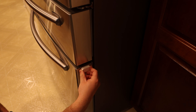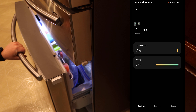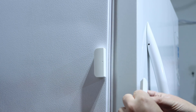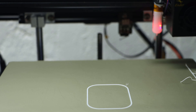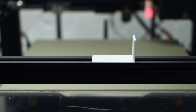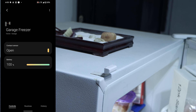With a freezer and middle drawer combination like mine, I can do something similar to the French door setup but on the side. Having the contact sensor on the bottom freezer drawer with the magnet on the middle drawer means if either are opened, the contact sensor will be open too. If you have a standing or chest freezer I highly recommend setting this automation up for those as well — they tend to be less visible, so when they're left open they usually go unnoticed for a long time. An issue you might run into with a standing or chest freezer is that the gap between the door and the body might be too far for a sensor to detect a magnet. I printed a general-purpose mount to allow for easily adjusting where a magnet sits, and I have a link for the file in the description below.